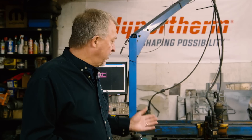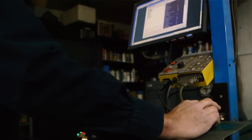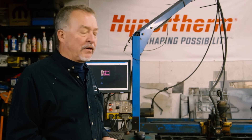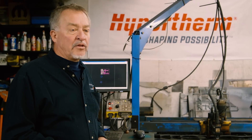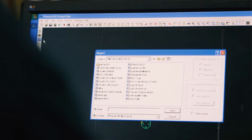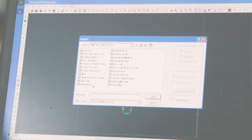Some of the things to look at with the tables is the software. The CAD software is what you actually draw the part with. The CAM software and the machine control software are kind of embedded in the machine and are doing things in the background with any CNC cutting table. If you have no experience with computers, look carefully at the software. If you have a lot of experience and you've done some CAD drawing before, you can probably run any one of these tables pretty easily.